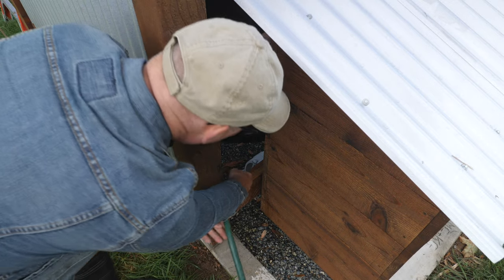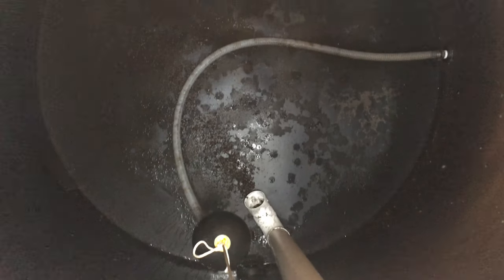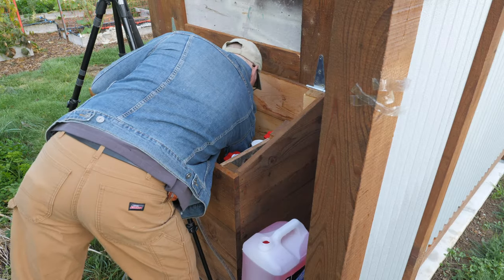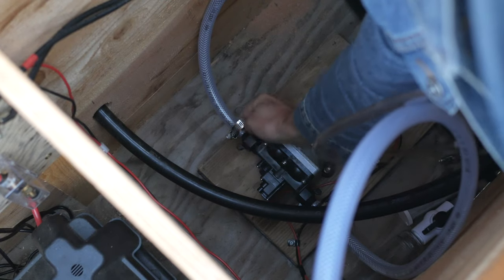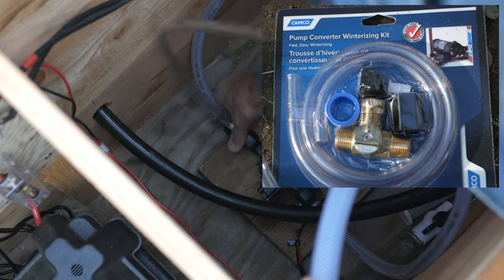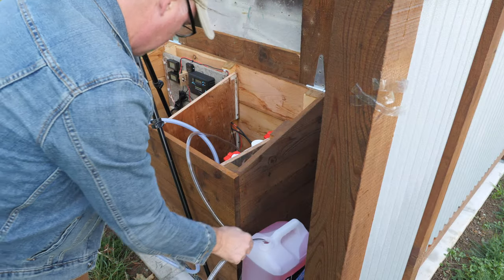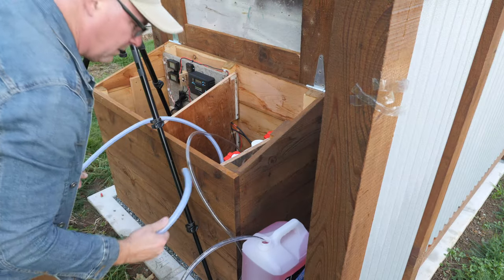I'll drop the utility pump into the 500 gallon tank to drain it next. The 12 volt pump could just be disconnected from the water lines and brought indoors for the winter, but I decided to leave it in place and run some antifreeze through it. I had an RV winterizing kit with a spare barb fitting for a hose, and I used this — it worked well.